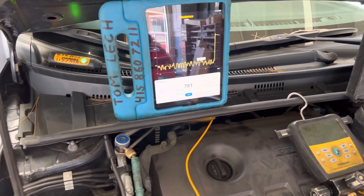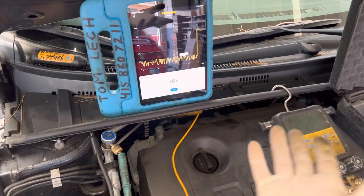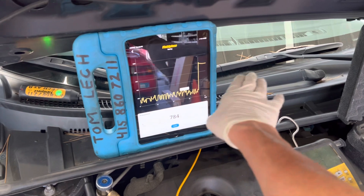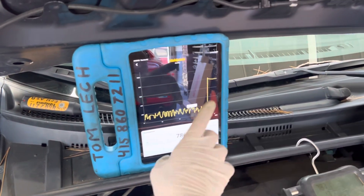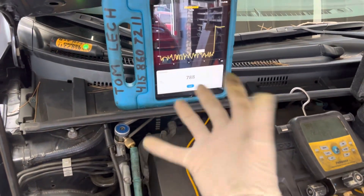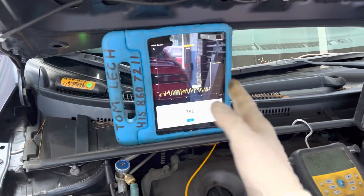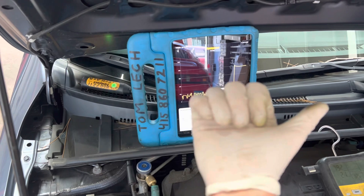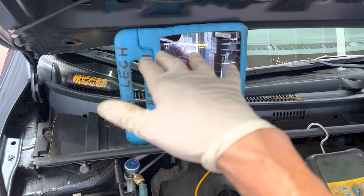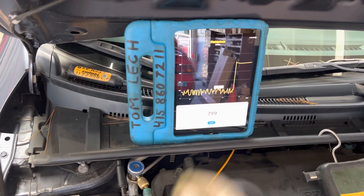The vacuum inside your whole system has to stabilize and settle out. You'll see this go down — sometimes you see them go up, sometimes you see them move a little bit. They're not a perfectly flat line. It's kind of like water inside a long jug or pipe: you have a little bit of water, you swoosh it, and there's more water on one side than the other. Gravity brings it back and forth until it becomes steady and the water doesn't move anymore. Micron levels work roughly the same way.